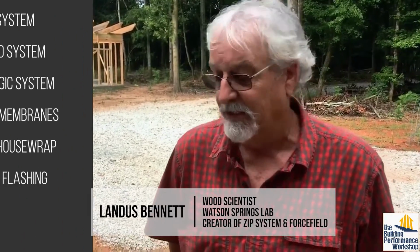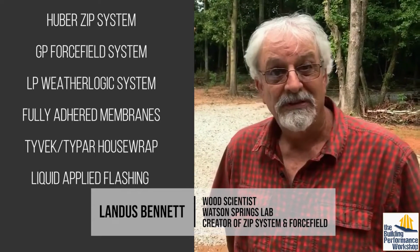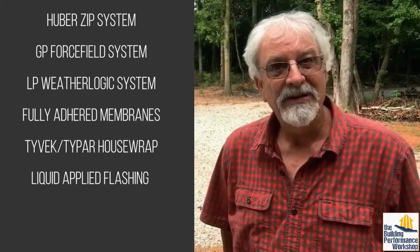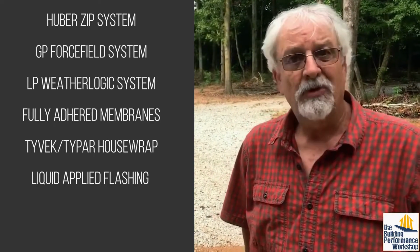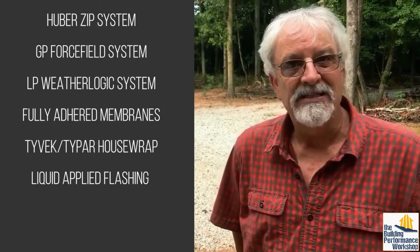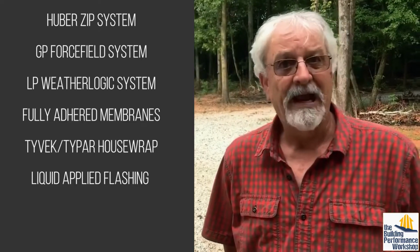Well, I could say this. We've tested enough of the zip and the force field systems and all systems to understand that the failure modes are the same. So it really depends on the builder and how it's constructed. If you don't build correctly and you have leaks, I don't care what you put up there, it could be zip or force field or Housewrap, you're going to have trouble.